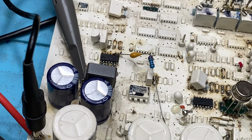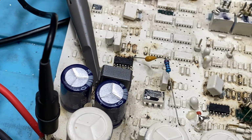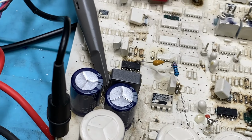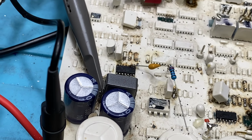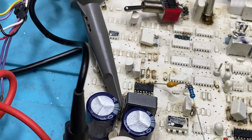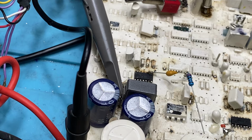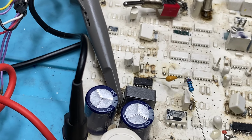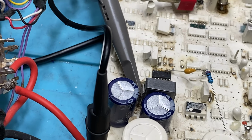where those blue capacitors are. They're normally 1000 microfarad. You've got to change them to bigger caps to hold more energy, because it has to hold the voltage up during the off time, which we're going to introduce. They're 3300s. I think we had them at the time. You can get bigger ones now for sure in the same footprint.